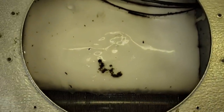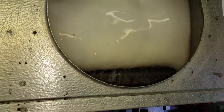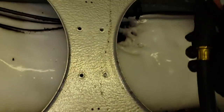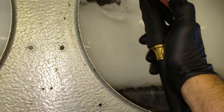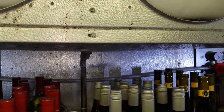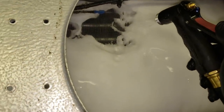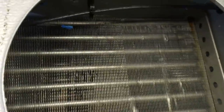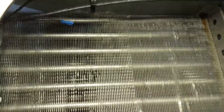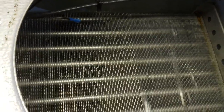I got the fan motors all out and you can see the abnormal icing pattern - definitely something going on there. So we're going to start using the hot water hose and defrosting this stuff. Notice how we're just going a little bit at a time because we don't want to overflow the drain. We don't want water to start dripping out of the coil. I got a drip so I stop. It's a slow process, it's not a race. Not making a mess. As I'm defrosting, just because the coil is clear from the front, it's not clear of ice on the back. I'm continuing to defrost from the front side, nice and slow, steaming all the ice off the back. There's no need to get onto the back - if I just steam it from the front, eventually it's just all going to fall off as one big chunk.